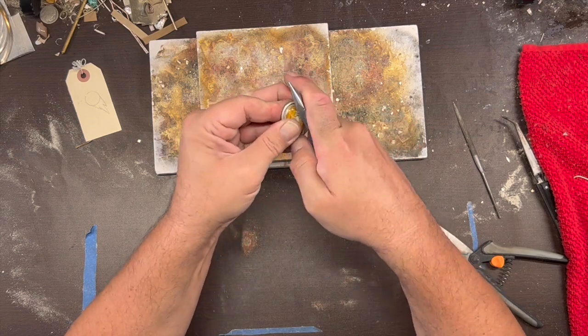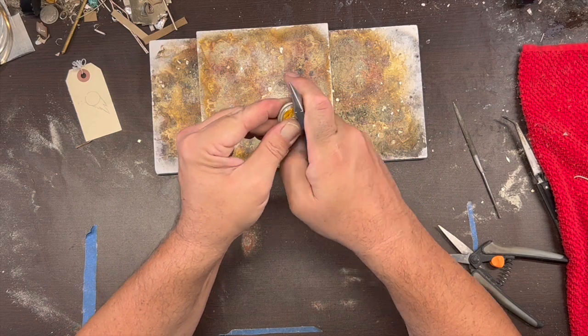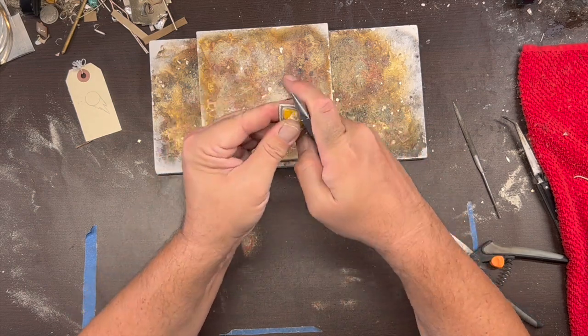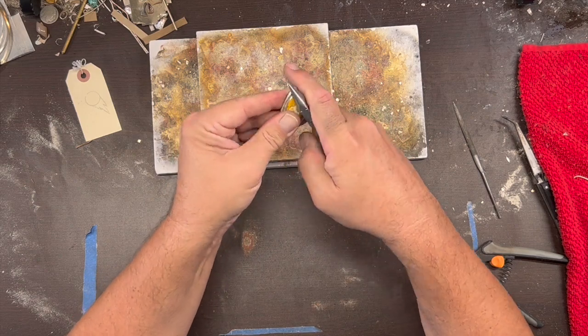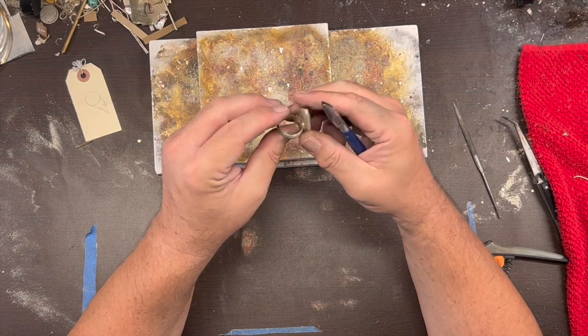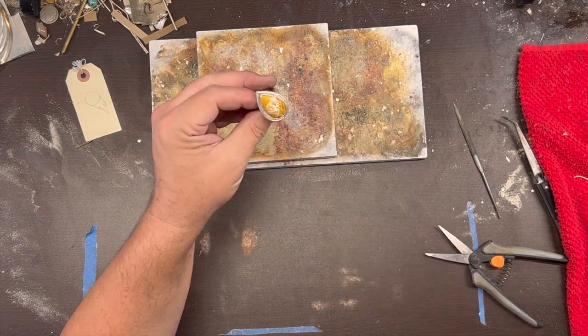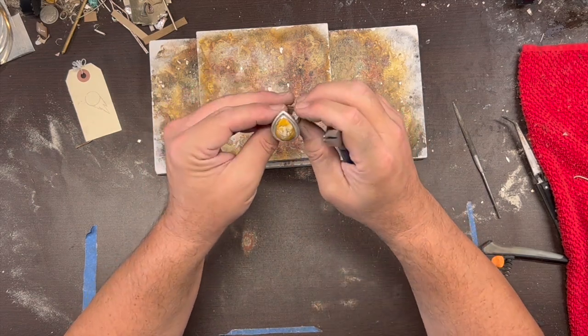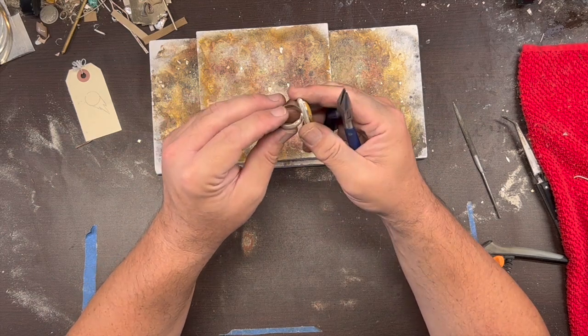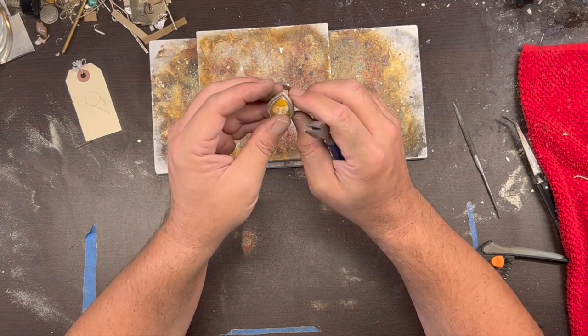So just tighten it down all the way around, and then we'll do a burnish on it. And then what I will do on this one is I'm gonna take it back to the polishing machine and give it the initial polish on the first wheel, which is with a compound called white diamond, and it's a more abrasive polish, gets rid of all the scratches.